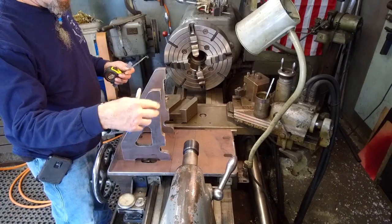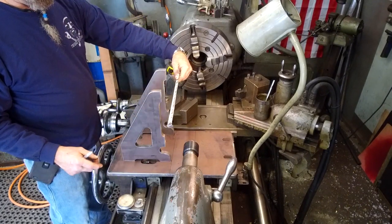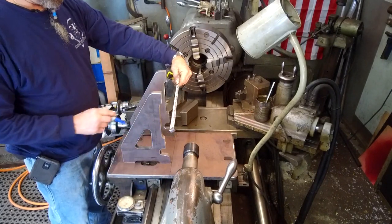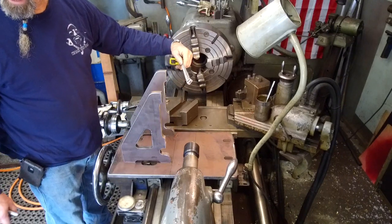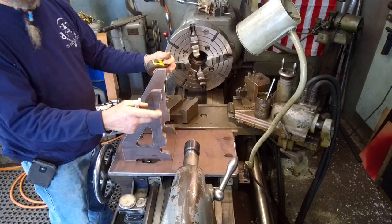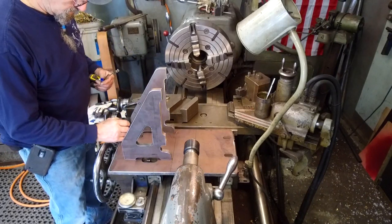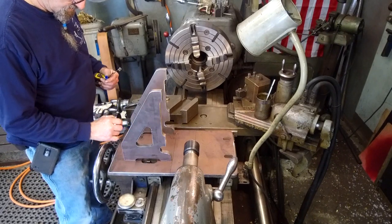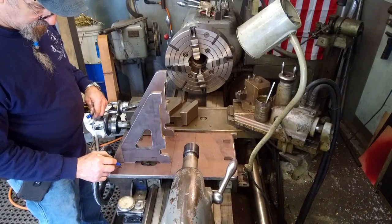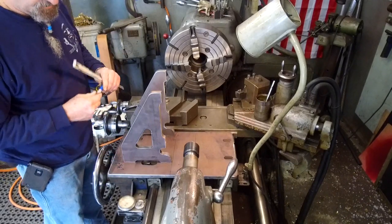I know it's a little hard to see from that direction, but basically we have a 13 inch wide plate coming in here, which will overhang an inch on this side and an inch on this side of the base plate. Our part's 10 inches on the outside, and I may want to be clamping on the outside of these webs right here. So we're going to settle for 7.5 inches in between here. This will be 3/4 of an inch off the forward side here, and we are 2 5/8 off of this side over here.